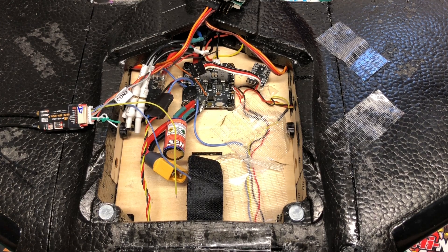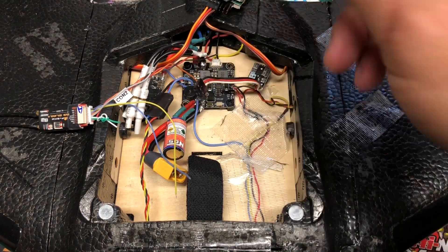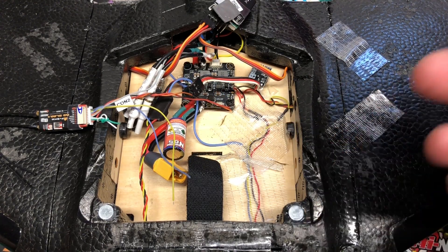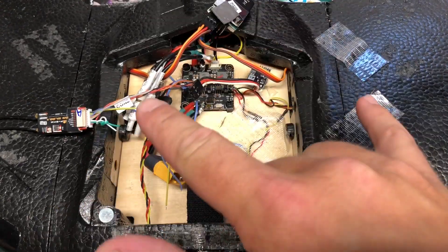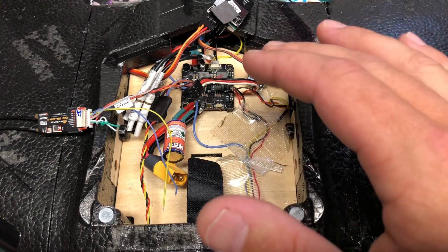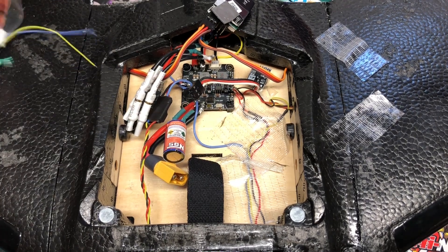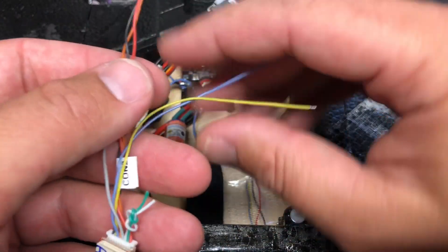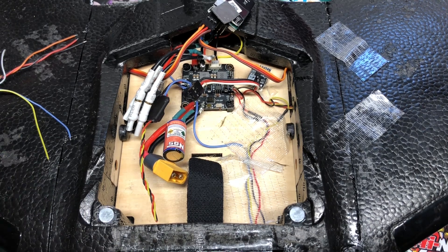The R9 receiver with telemetry is somewhere around $50, but this guy is $25. Even though it's half the price, it is half the functionality. It's not going to be as simple as plugging in servo cables like on a D4R2. You're going to have to figure out a way to power your servos — on a wing, for example — through a regulator or another pathway, to get long range without paying for that expensive receiver.